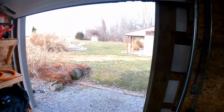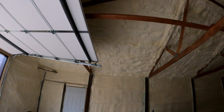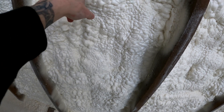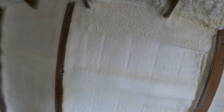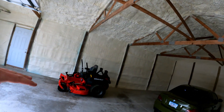Let's give you an update on the barn — it is finally spray foamed. They did a really good job. They did closed cell on the walls and open cell on the ceiling, which is why the ceiling kind of looks like popcorn — it's softer, you can poke your finger into it, and it'll absorb water if you spray it enough. The walls are rock hard. There's approximately six inches of open cell on the roof and about an inch and a half to two inches of closed cell on the walls.